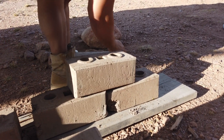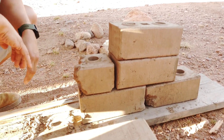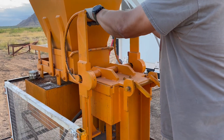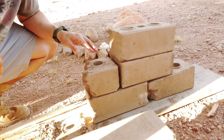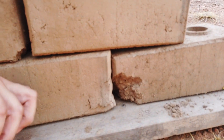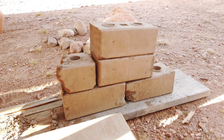That difference in size is because we didn't know — this brick came out of the one that we couldn't compress down. During the middle of the process we had an issue with our electricity and the circuit cut out, so we ended up with a bunch of our mix sitting in the hopper of the machine hardening. We had to rush to get the circuit working, and the easiest way to get the mix out is to actually make a brick — it's really hard to get the mix out of the hopper otherwise because gravity doesn't work in your favor. So this brick is taller because it was already starting to harden up and the machine didn't have enough power to compress it any further. So a lot of this learning process is going to be learning to be more consistent.